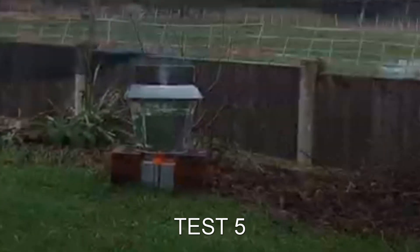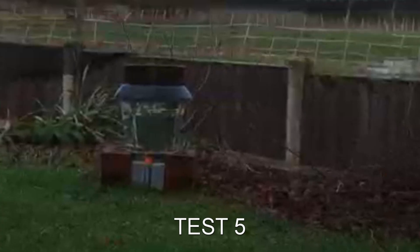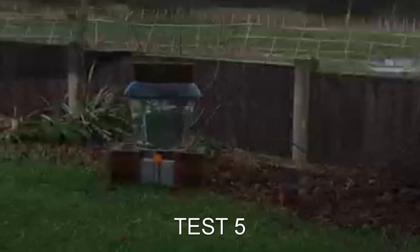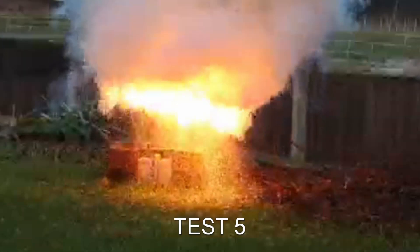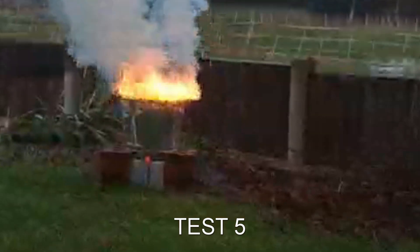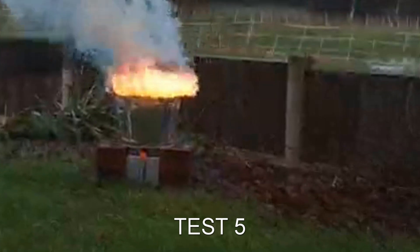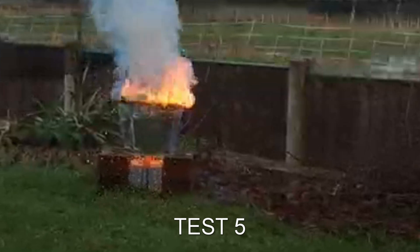Although the thermite casting was unsuccessful, I did prove that maximum yield can be achieved by adding approximately 10% iron granules. In summary, to make this work the thermite needs to have 10% iron granules added, in a clay pot with a secondary steel bucket retainer and a conical shaped exit at the bottom covered with tin foil to act as a burst disc, and a lid on top to deflect the blast downwards. It is unlikely that this will be useful going forwards, unless it is the zombie apocalypse and I need to make an axe in a hurry.